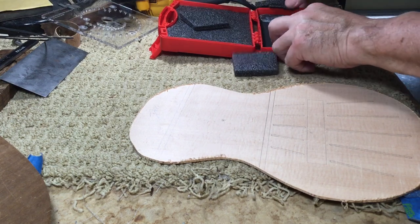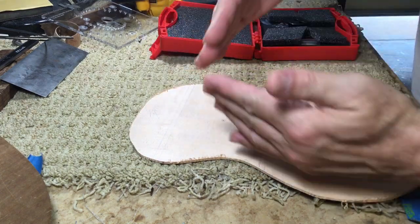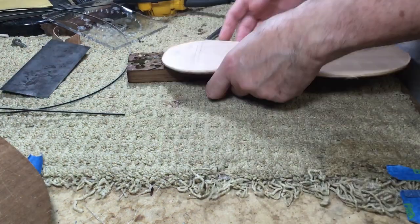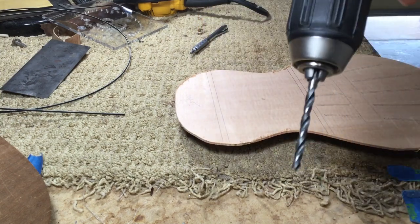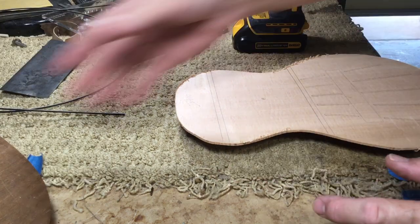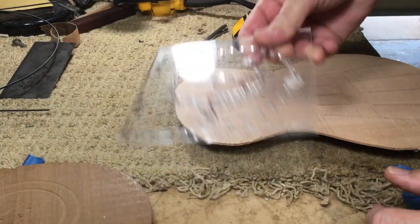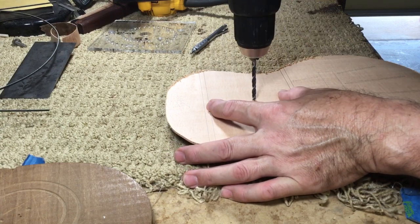I got this one off of Amazon. There's tons of them, different types. I'm glad I got the one with the less steep punch, because I've drilled some aluminum recently. What I also ordered was, and normally I wouldn't do this here, but we're just walking through things, a pilot point 3/16 bit. The 3/16 bit covers a number of things. It fits the 3/16 inch pin that I use for cutting my sound hole, and it fits my circle cutting jig, which we'll talk about in a little bit. Let me get my glasses on, no fan, and we'll cut this hole real quick.